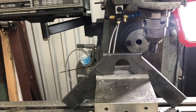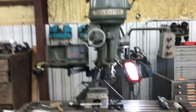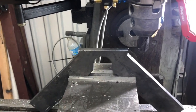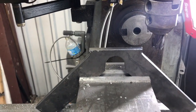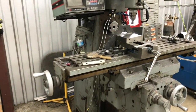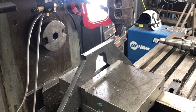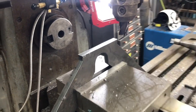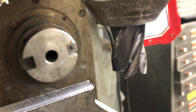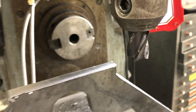Anyway guys, I thought I'd just make you a quick video on how this big mill can power through stuff. Not really the most rigid setup with this being up so high, but it did pretty well. The power feed is not on here — there's no power feed, so I was just hand feeding that. I don't know what the feed rate was, I was just going by feel. I'm sure it could have taken a lot more. And that's a one-inch four-flute carbide — I think it's a Gar brand that I bought off eBay. All right guys, see you.